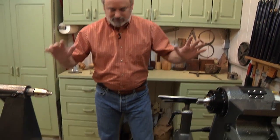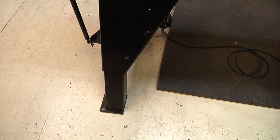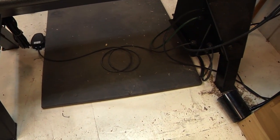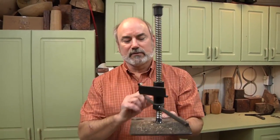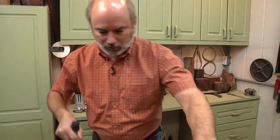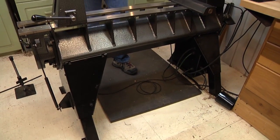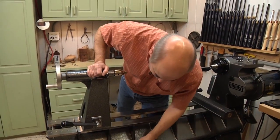This lathe is remarkably well designed, and that's what I like about it. My stubby had a base plate so it was flat on the floor, and we had a lot of troubles because my shop is wobbly and wonky. But if you look at this, it has four legs that are individually adjusted. The nice thing about that is they designed a really cool lift system so you can pick up one end of the lathe and adjust the legs the way you want them.